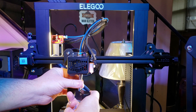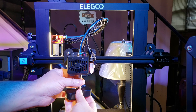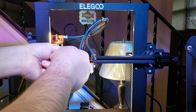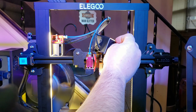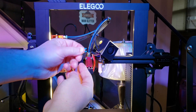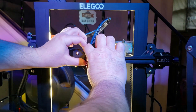I'll start out by pretending to remove the nozzle, because I had already done so before hitting record on the video. Remove the fan shroud by loosening the two screws at the top and put that off to the side. Remove the blue clip from the pneumatic fitting, and then fight with the Capricorn tubing, because nothing can go right during a disassembly video.